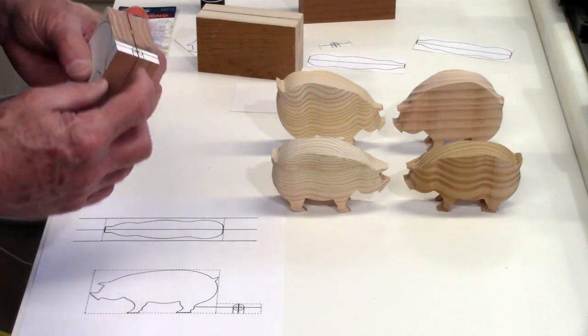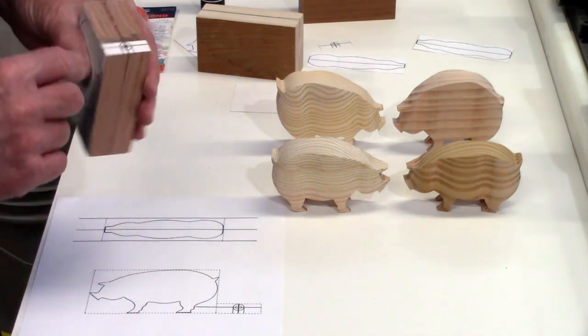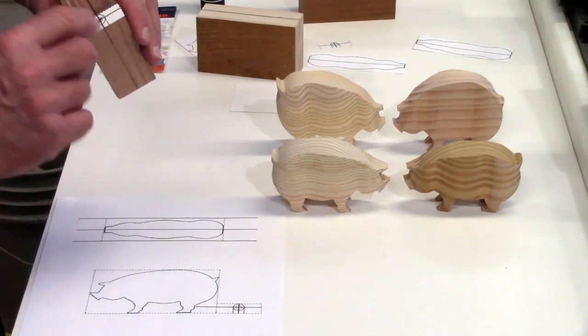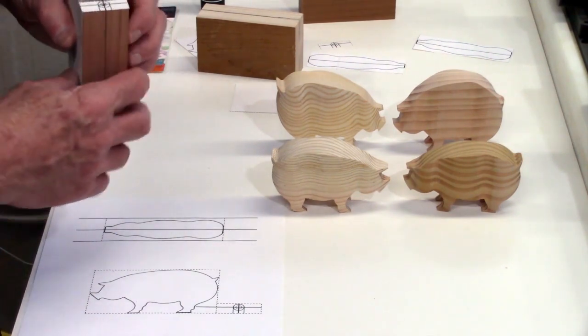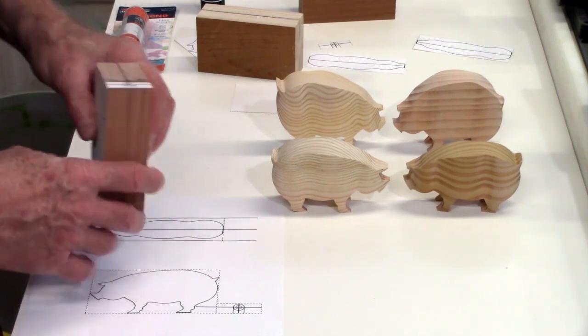And in order to get the legs cleared out, I have part of the pattern wrap around here so you can line it up and drill a 3/8 hole down. Then cut, and then you can just finish cutting it out on the bandsaw.